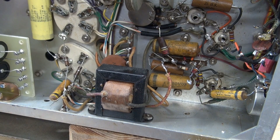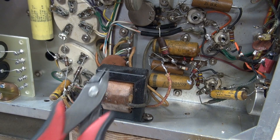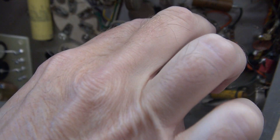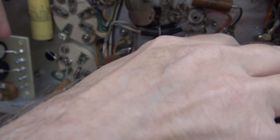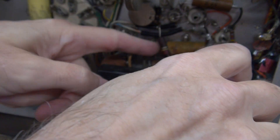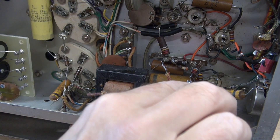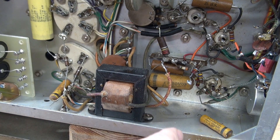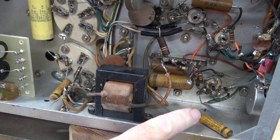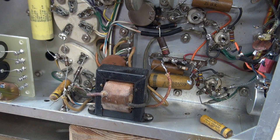I'm going to start with the audio section. I take a couple pictures just for reference, but if you have the schematic it's pretty easy to rebuild. I just take a pair of wire cutters and clip out this old stuff. I don't worry too much about where it was — it's all got to come out. All these wax caps are bad news. I'll clip all those out, and I'm sure all these resistors are way out of tolerance. There's no reason to try to save the old ones — just completely rebuild the audio preamp section and it will work great.